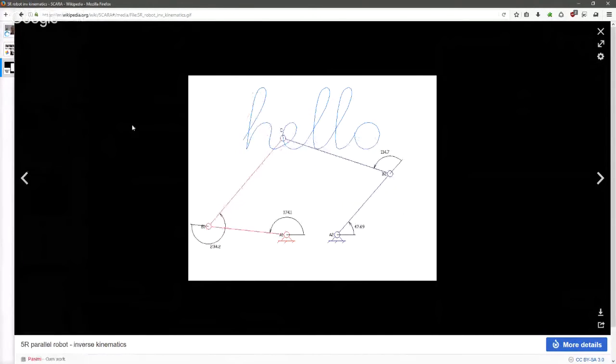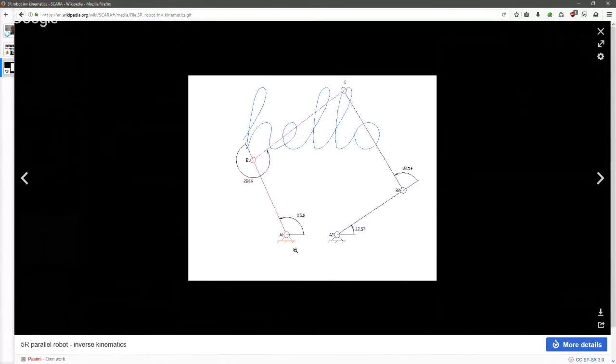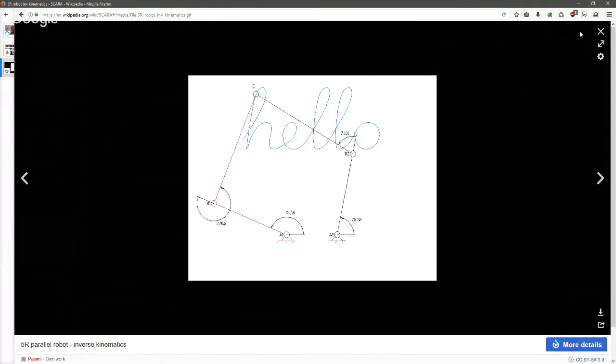Yes, you might be able to build it a bit more elegantly with different components and stuff. But even these long arms here pose a real stiffness issue. So again, it's a nice design. It's novel. It's sort of like the design that Deltas would be if Deltas wouldn't be able to print taller and stuff. I don't know. Again, it really doesn't offer any advantages over the typical Cartesian machine. If you build a Cartesian printer well, it's going to print insanely well, and it's not going to show any of the artifacts of a Delta or a SCARA or a Polar printer. And why would you have to do anything else if you've got a concept that works and is mechanically simple and just works for the job you want to achieve? So yeah, that's going to be it for today.